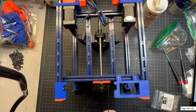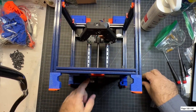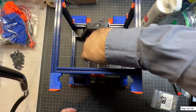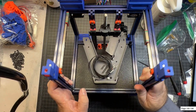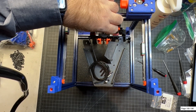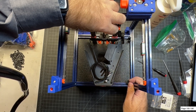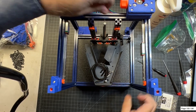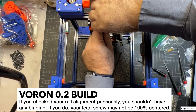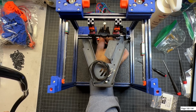I went ahead and put these screws back in. I'm going to flip it over so I can get to the screws on the bottom face of the extrusion — get those nice and tight, you don't want this moving around. Now the manual wants you to test it manually up and down to make sure it's smooth with no binding. Go all the way down and all the way up. Mine feels really good, no binding. Better to test now and get mechanical issues ironed out than to wait until later.